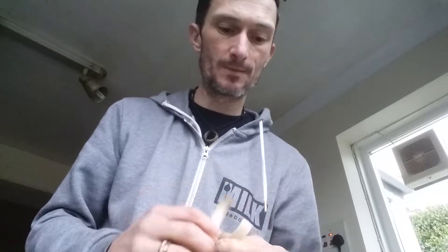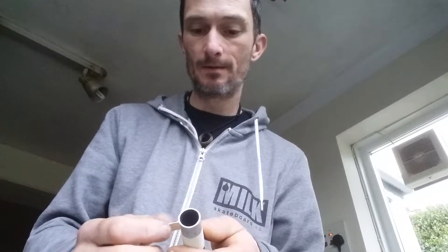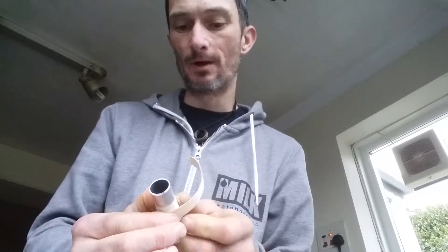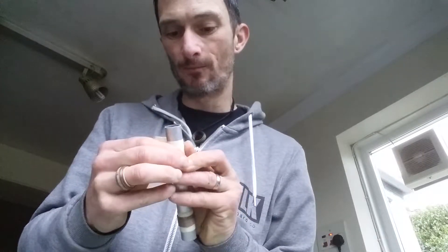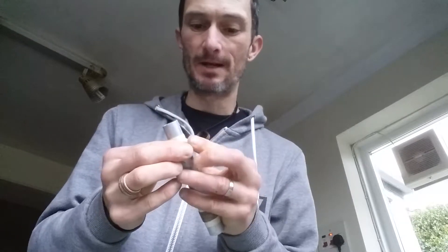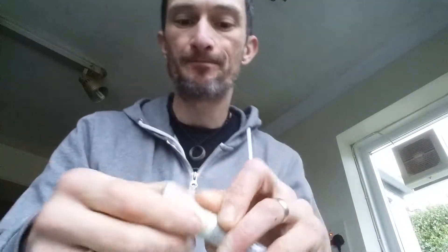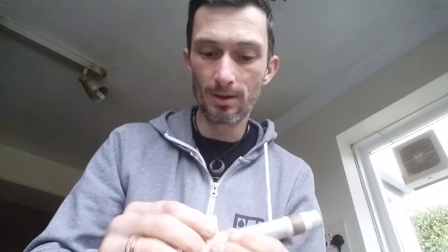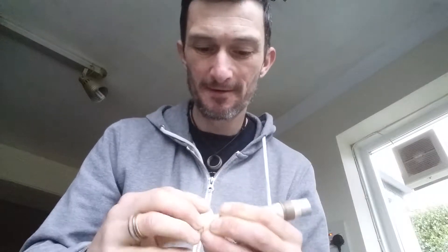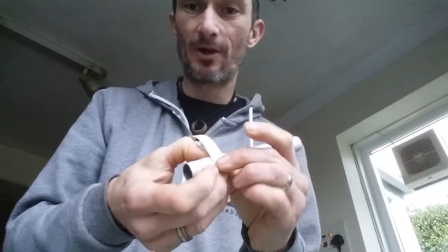So just get that nicely feathered down like that, so you've got two ends that are feathered out. Next, work that on there and just make sure that it is going to wrap straight — there's nothing worse than it not wrapping straight. I normally cut these veneers to about 12mm wide, so that gives me a bit of room just in case it doesn't wrap straight.